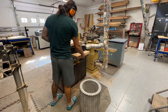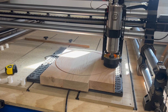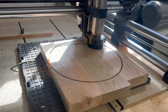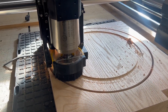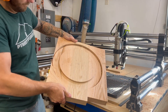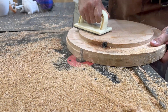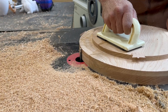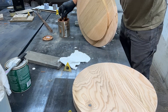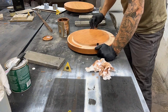The wood is pretty gray from being out in the sun for a long time — that's just what happens when it gets baked by the sun, so it didn't really pay to use anything expensive. Red oak is relatively affordable and I've had this stuff laying around forever. Then back to the CNC to give these babies some shape — first we need them round, made about an eighth inch bigger than the concrete pillars. Then I cut down into them to give it a lip so they wouldn't slide off and would hold in place properly. Just like that we have some tops. I used a flush trim bit to clean them up, then gave them a quick sanding before giving them some stain — I really didn't want to stain them but they had to match the gazebo, so we used the same stain we mixed for it. Then I gave them a nice hefty coat of poly to give them the best chance of the color lasting.